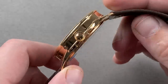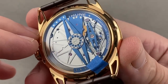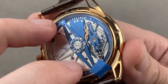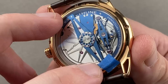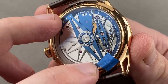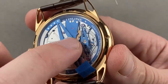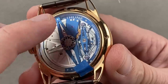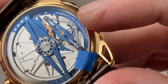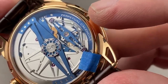They make their own cases and movements. The perpetual calendar is powered by a version of the 2024 automatic. At center, there's a patented shock protection system so the rotor is well-braced, allowing a huge lever arm to maximize the mechanical advantage of the winding system, which uses a fired blue titanium arm and a platinum mass. Automatic winding, five-day power reserve, three shock protection springs over the balance, and the balance is non-annular — it's actually a yoke — with platinum masses and a fired blue titanium wheel.